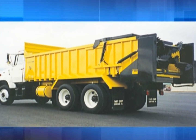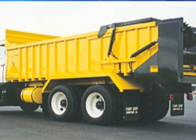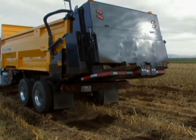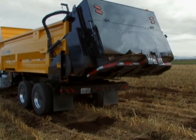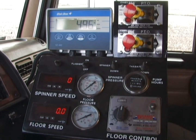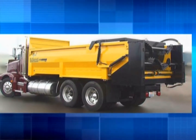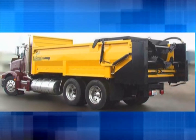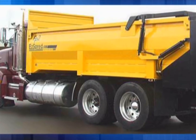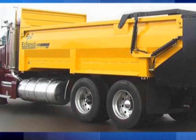The Fluid Power series of spreaders was developed 14 years ago and incorporated many innovative design ideas: tip-out beater assembly, dual hydraulic pumps housed in a common case, the ability to stop the floor before overloading the beaters, and cab-mounted controls. The next series, the FP2 Easy Spread, added even more features such as hydraulic adjustment for floor chains and redesigned sides, while still retaining the original proven hydraulic system.